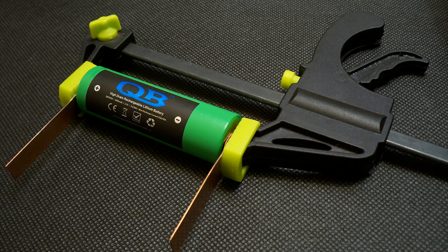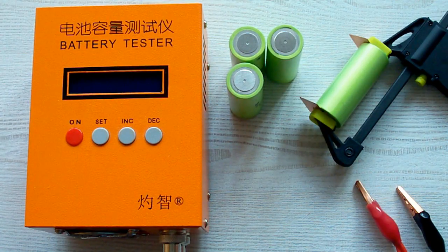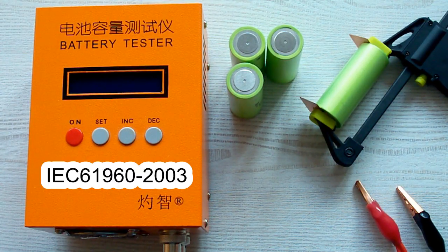I've upgraded my battery holder to version 3.0. I've made contact pads from 0.5mm pure copper sheet. The positive terminal is 9mm wide and the negative terminal is 11.5mm wide. The pads are designed to provide good connection even with batteries which have deep-placed positive or negative contacts. I've followed all the prescriptions of the IEC 61960 standard concerning battery capacity measurement.